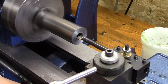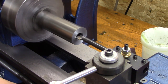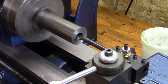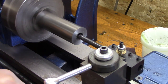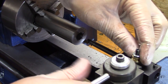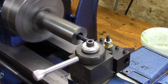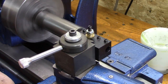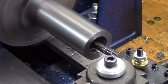Now it's time to do some boring. I did notice it wasn't cutting perfectly like it had been at one time. There are some things happening that I'm just not catching right now — the spindle is slowly getting a little loose. Like I said, I find that out in the next Journey to Journeyman episode. Right now I just know I have to take extremely light cuts and it's not cutting perfectly, but it is cutting nonetheless. I just have to take my time and go over it several times, and then it finally does cut.